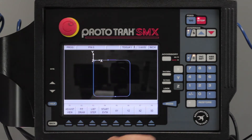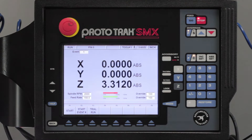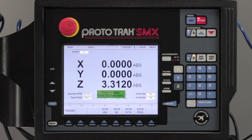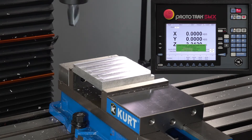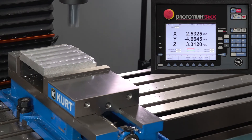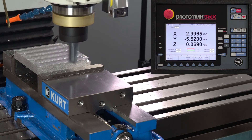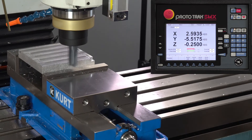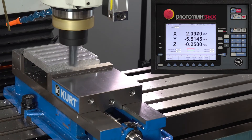The next thing I'm going to do is go to the run mode, but this time instead of starting at the beginning — because I've already cut this part — I'm going to start at event number five. It says when you're ready, press go. I've got the RSG over here so I can use that and not be in the way of the camera. It tells me again to start your spindle, and when you're ready push go. You can see that it came down on the opposite side and it's going to work towards the left side of the piece part.